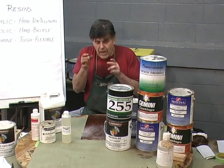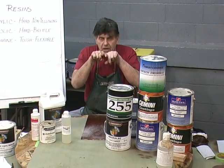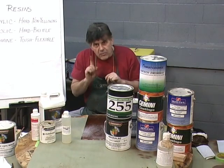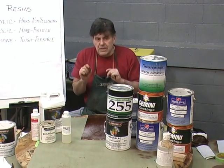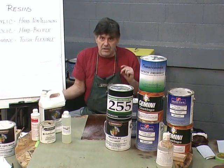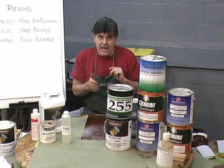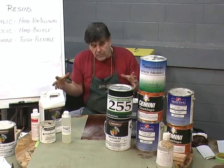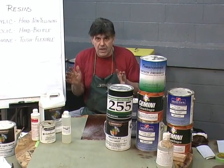And what happens is when they go down, they have to come together and glue together. Now, those two differences are the very reason that solvent-based products can be thinned just as thin as you want. Water base cannot. Like I've told you, if you thin that water base, you separate those molecules and you're going to get globby. It's awful.